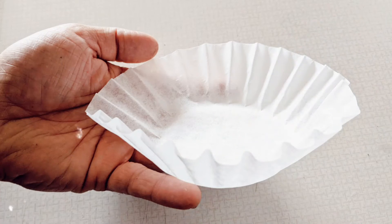I believe what's happening is the walls of the steel can are filtering out the changing magnetic field due to eddy currents being induced in them — they kind of reflect it away, and I think this is why we're not seeing the stronger induced motion as in the case with the plastic bucket.